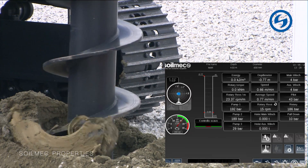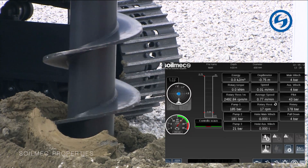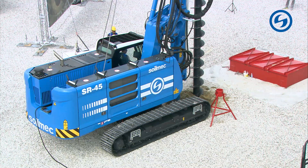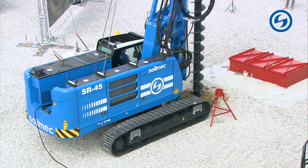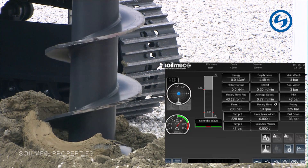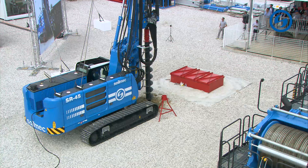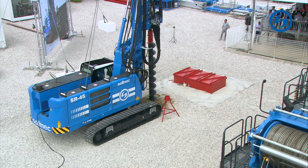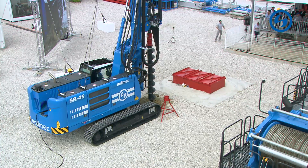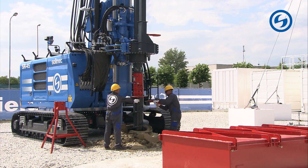In the lower right corner we see the DMS — in this case it's the latest version. You may have noticed the difference in appearance. We have a depth meter and we can also see the speed at which drilling is occurring. The operator will push down until the top auger section, or the connection point between the mounting tool and the auger, reaches a comfortable height for the ground operators.